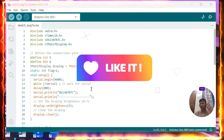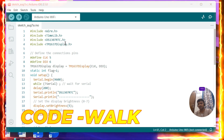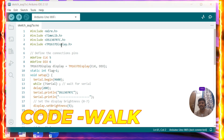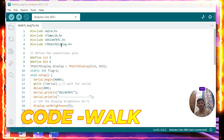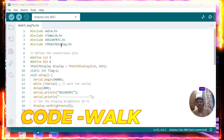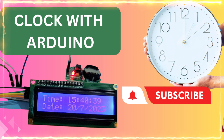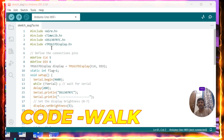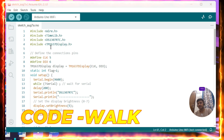I have opened the Arduino IDE 2.1.0 and pasted the code. For this project we are reading from the RTC — the prerequisite is the DS1307RTC library, which needs to be installed. Before reading you need to set the time and become familiar with the RTC. We have previously done this and read the time using the DS1307RTC — you can refer to that for understanding. For displaying the time on the TM1637, we need to install the TM1637 library.